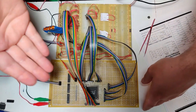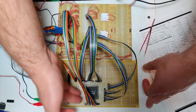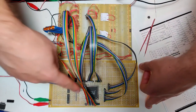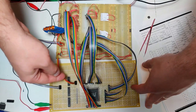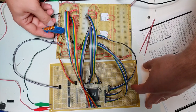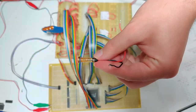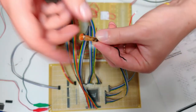And there is also the 16 bits that comes from the video side data bus, which doesn't have a set of wires here because that is going through, of course, into our mux section that we built last time, by way of these 16 pins that we're using to shove information to the muxes before, but now are just a waypoint. And of course, then what mux's output is being selected, which group of 4 bits, and finally the output from the muxes, the actual 4 bits that we're selecting, come out through this cable, and they're going into this weird little bodge, which is actually made out of, I love these things. Let me see if I can get this to focus up real quick. There we go. These are resistor inline panel mount LEDs that I got at Radio Shack when they were closing. You can see there's one right there.